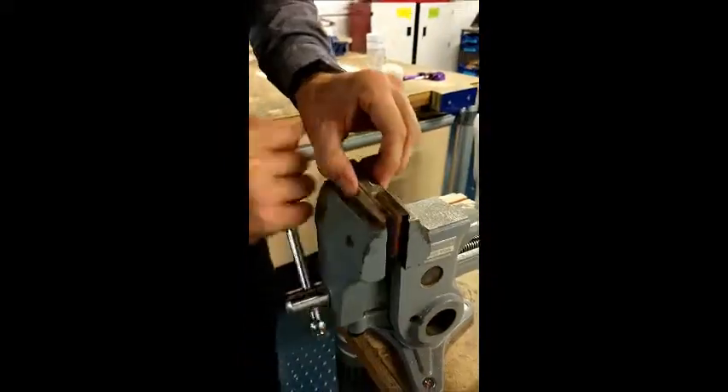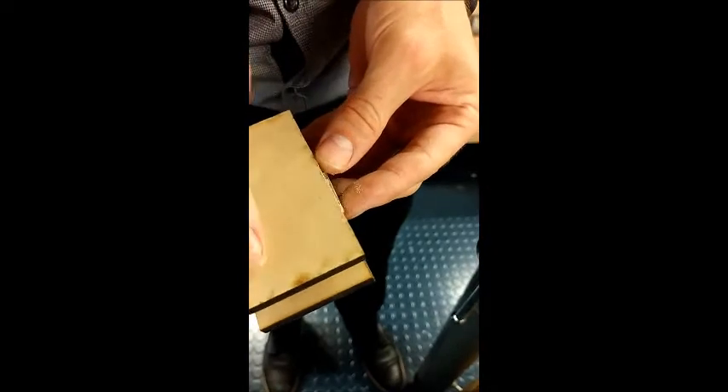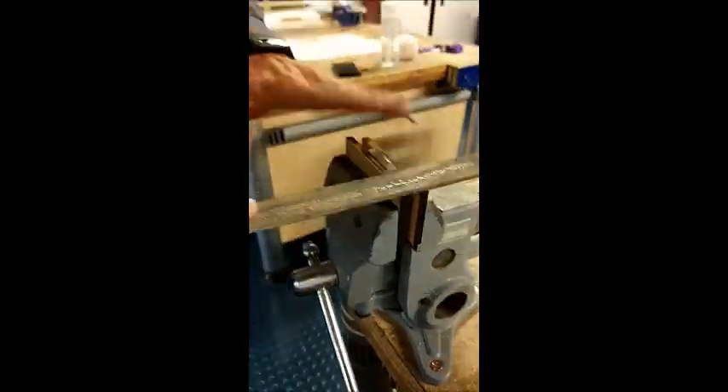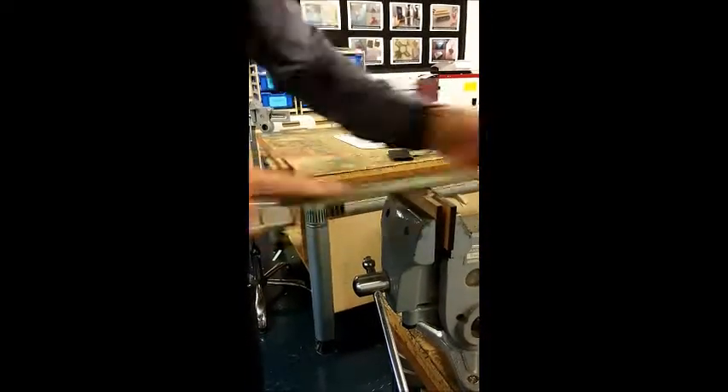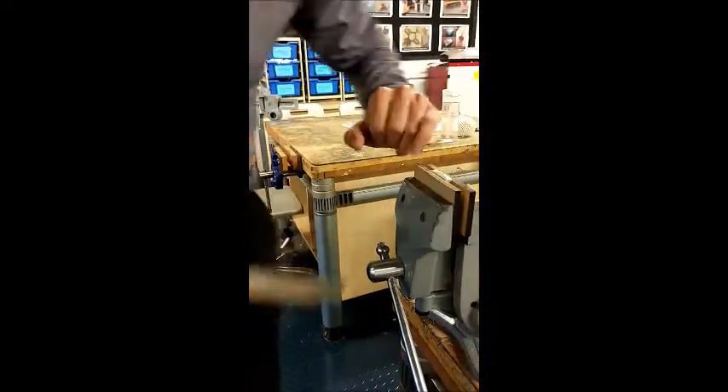I've not quite lined this up — when I get down to the MDF I've still got a millimetre or so to go, so I'll move this up and do it a little bit by eye. It is worth the time and effort to get this lined up accurately. I'm going to advance it up in the mould just a fraction like this — this is where it's helpful to spend time in your setup. I'm also being mindful to keep the file edge parallel to the top of the mould, filing until I get it completely flat.